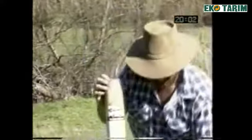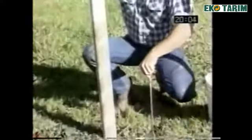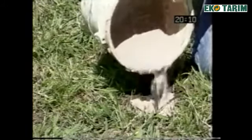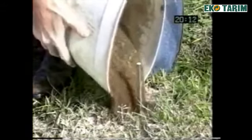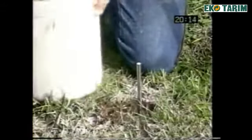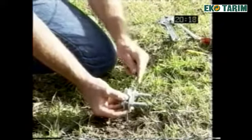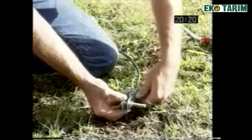A stainless steel rod is placed in the center of a seven centimeter or three inch diameter hole, one point two meters or four feet deep. A powder which retains moisture is mixed into a slurry and poured into the hole. It is then topped up with coarse sand or gravel. The earth wire is clamped to the top of this protruding rod, which results in an earthing system that really works.